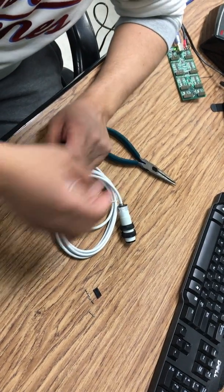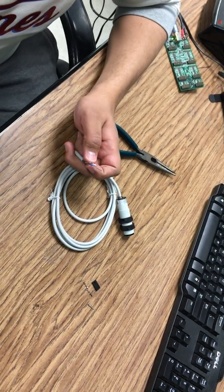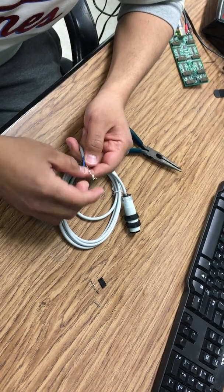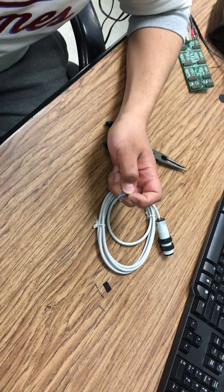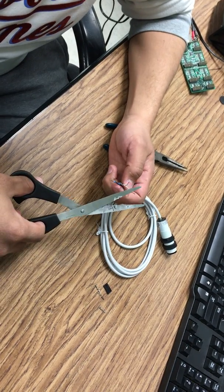What we need to do is connect the white terminal with the brown terminal so that we can make it a normally-open sensor. In this case, it starts connecting when it detects something.